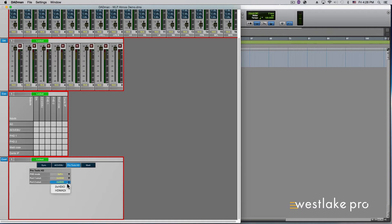You can choose 2x Primary for Port 1 on the Matrix to connect to Port 1 of your Pro Tools HDX card, and Port 2 of the Matrix to Port 2 of your Pro Tools HDX card. This allows both ports of your HDX card to be connected to your Pro Tools Matrix, and each port of the Matrix will emulate 2 HDIOs.